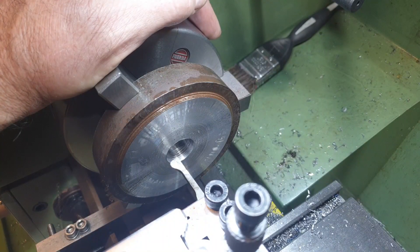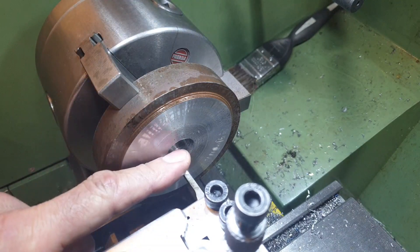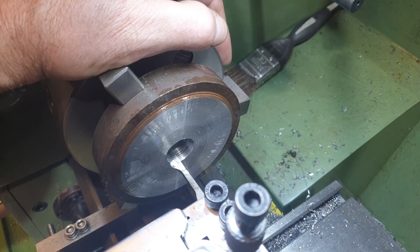The hole has been drilled out as far as I can go with drills — 20mm diameter, my largest drill. So from here onwards it's going to be boring. I'll start off with a high speed steel tool piece, and once I get the diameter larger I'll stick in a carbide tip tool, though it's not quite big enough for 20mm. I've got to take this all the way out to a 52mm diameter, so there's a lot of material to come off.